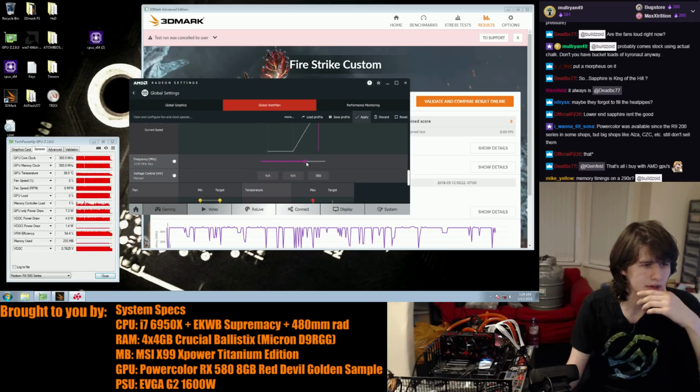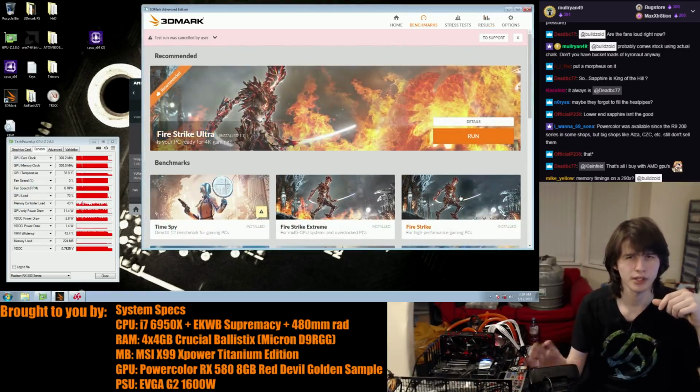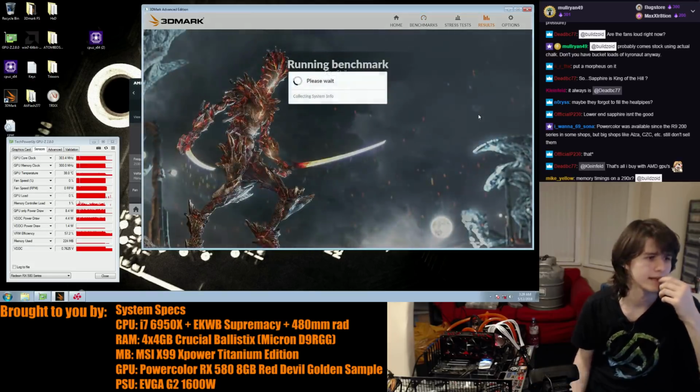We're going to go in steps of 100 megahertz. Well, 2100 should work on like every Polaris chip ever. 2200 and 2250 is like good chips. So yeah, let's just run that again.